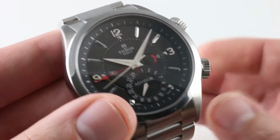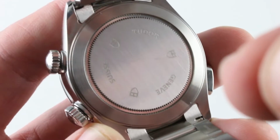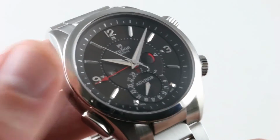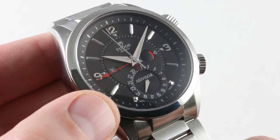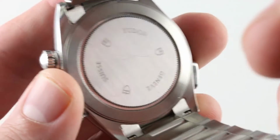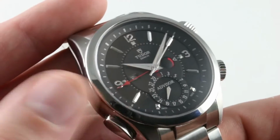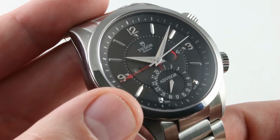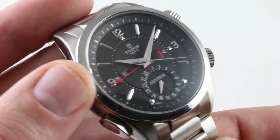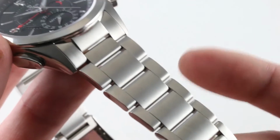Let me go over what's inside this 100-meter water-resistant case. Well, it's a hybrid of something familiar and something a little bit exotic. This is the most complicated Tudor ever made, and the module that enables the alarm is absolutely Tudor's. The on-off, the power reserve, the alarm function, that's all Tudor. The base caliber is an ETA 2892, so thin, fine, automatic winding, 28,800 vibrations per hour. It features both a quick-set date in radial form and hacking seconds. You've got that 42-hour power reserve, of course, the 100-meter water resistance that makes this an all-the-time watch, not just a modern-sized dress watch. So you have a great deal of capability built into this automatic winding 100-meter water-resistant steel and titanium sports watch on a bracelet.